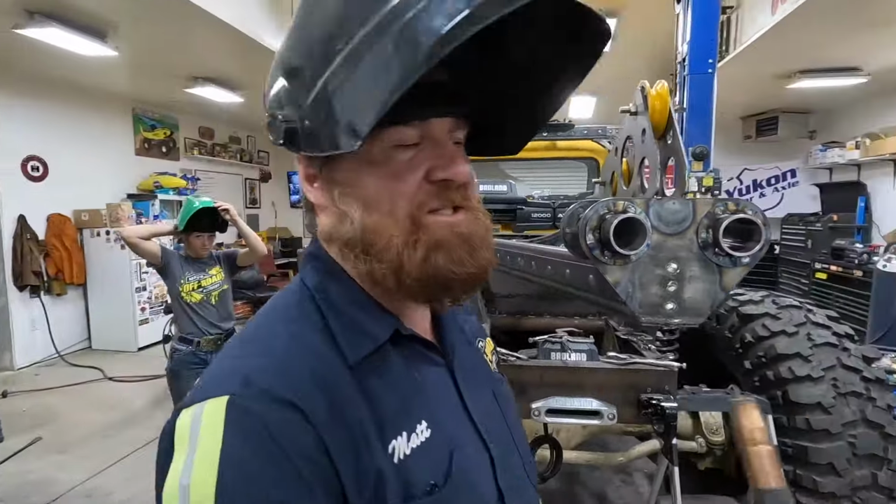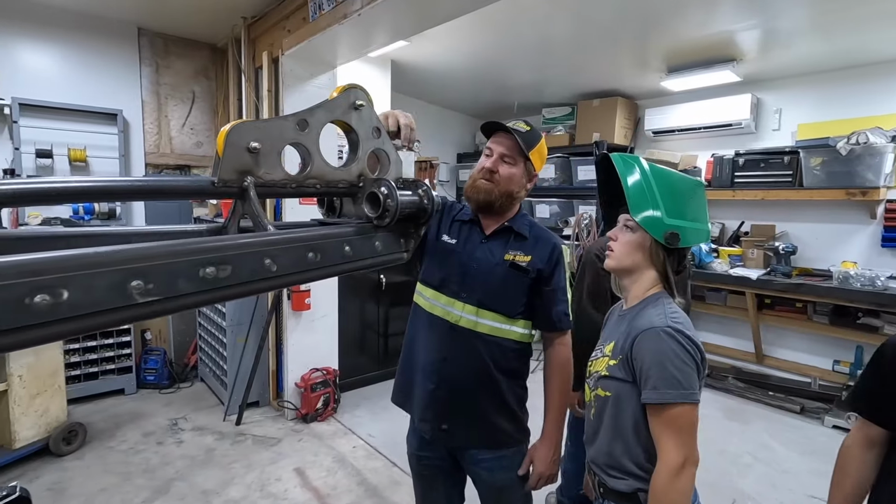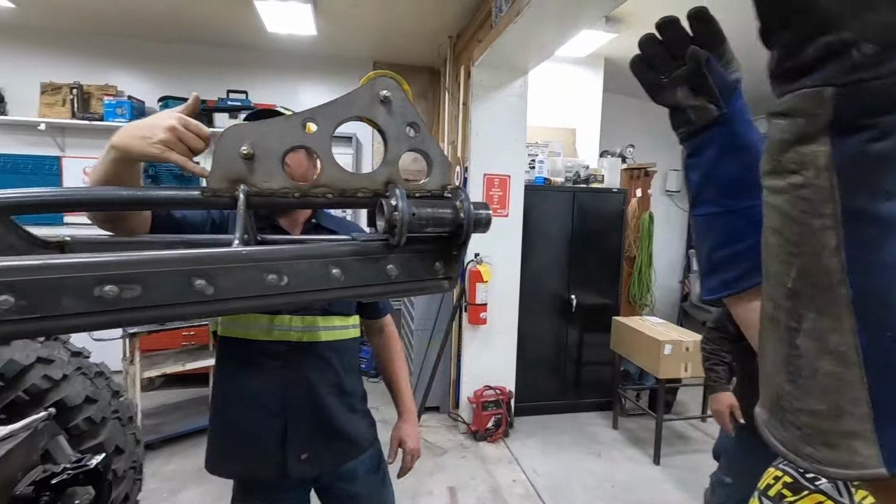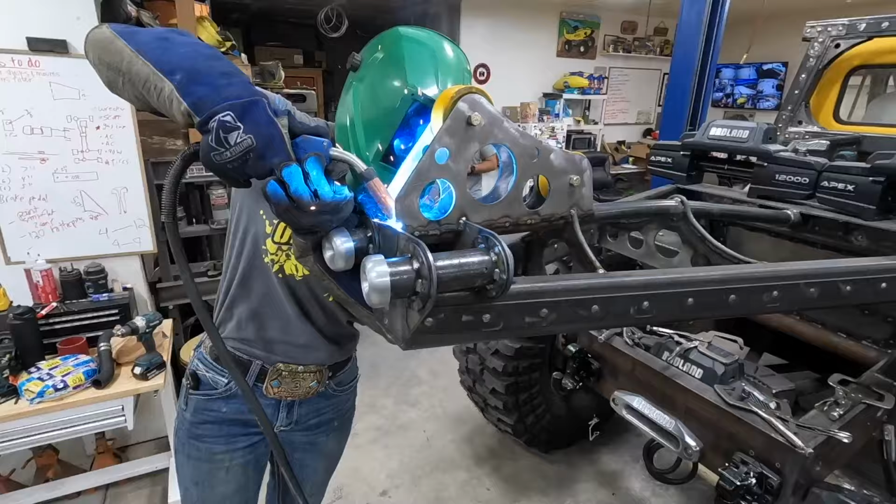We're gonna let Lizzie finish this. So before Skeeter gets the strap put on, just reach in there and get me a 1-inch weld there, 1-inch weld there. Reach in here, same thing, 1-inch weld, 1-inch weld.